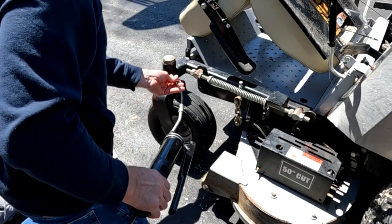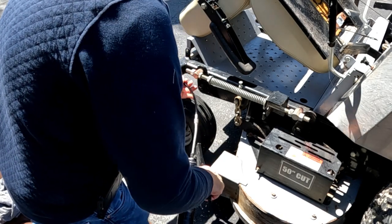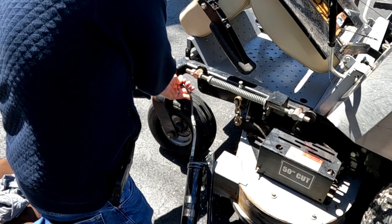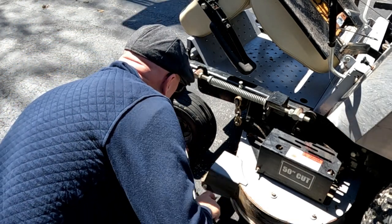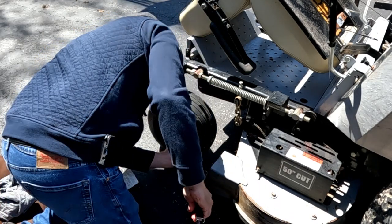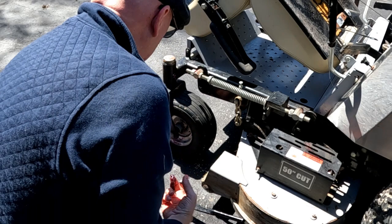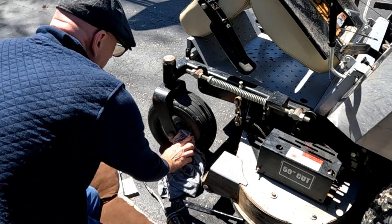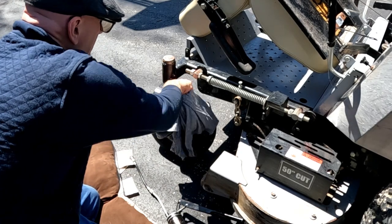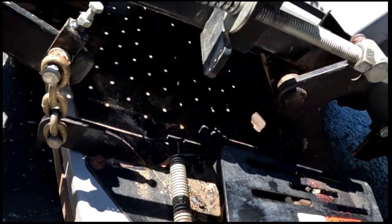Alright, so I'm going to find all of the grease fittings, get on them, and pump it through. You can see the old grease coming out — that means that fitting is full. One on the wheel here — that one's full. I'm going to go around every grease fitting I find on this and fill it up, then wipe everything clean when done. There are also some grease fittings on the top side of these spindles — be sure to get all three of those as well.